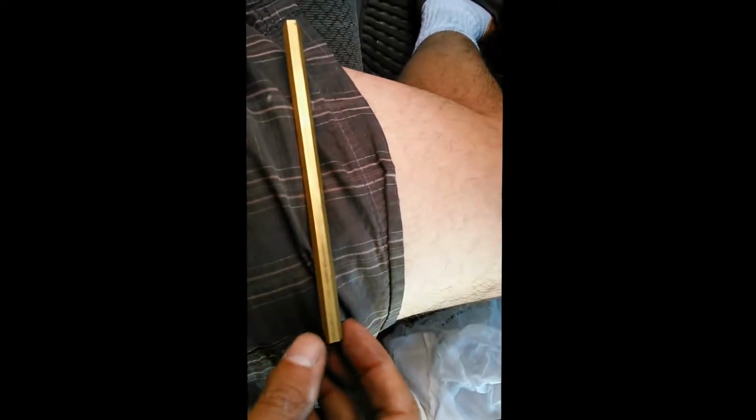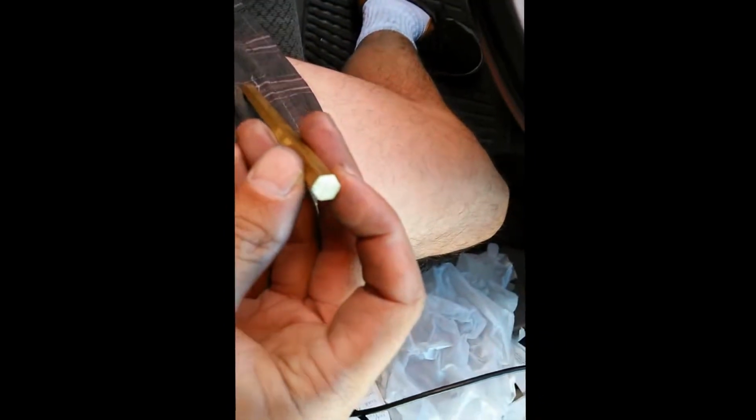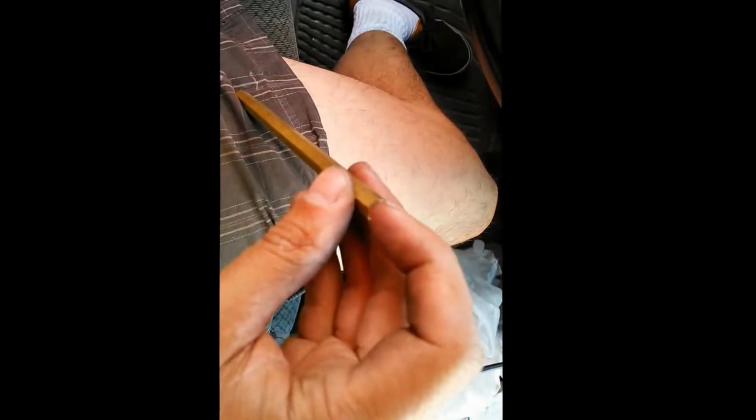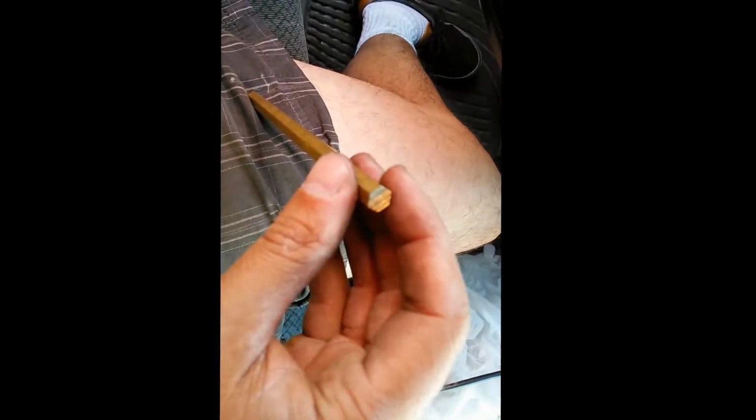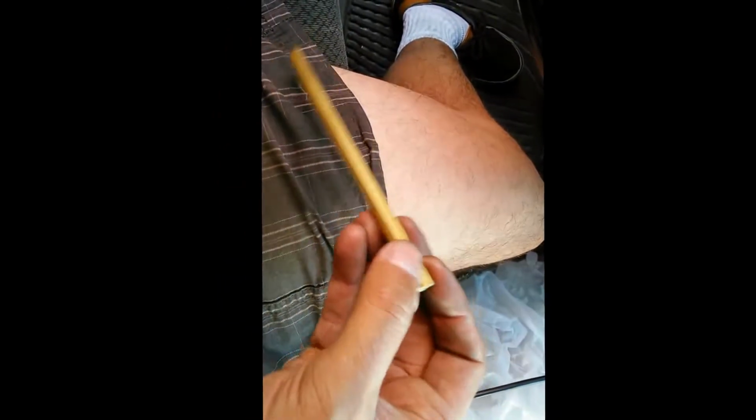It's not a super critical dimension, but I always want to have pieces that are consistent, and the way to do that is to machine each end. Also, when the drill starts in here, I have to actually use a pilot and then a drill to get that hole going. If I had to say anything about doing work on a lathe like this, it's making sure that you're consistent.